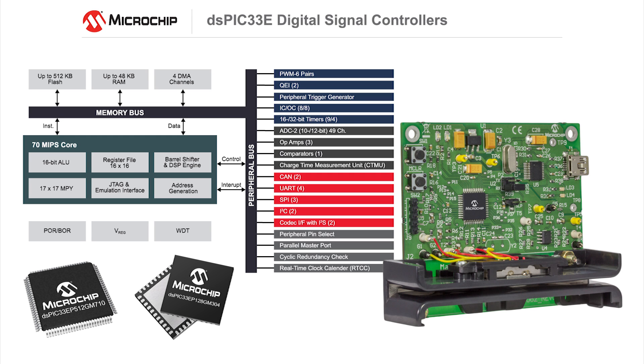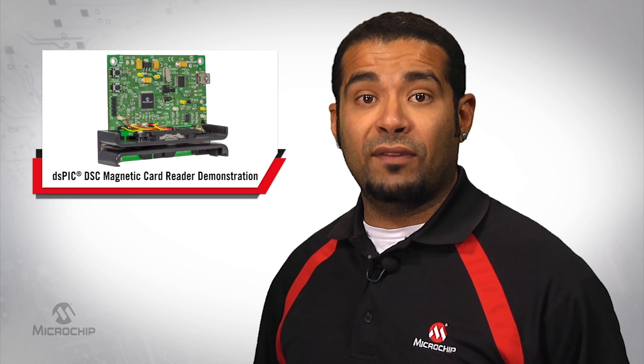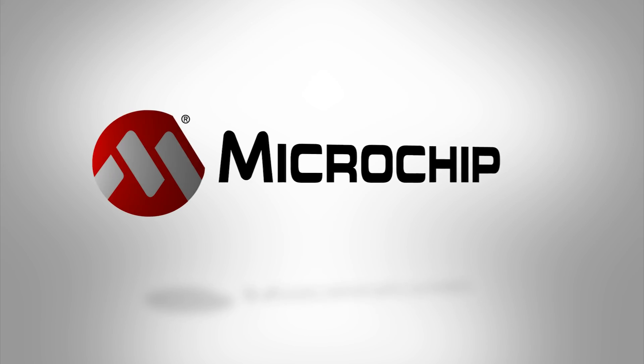Customers who prefer integrated op-amps can use the DSPIC solution covered in this tutorial. But in addition, Microchip also offers an alternate solution for customers who prefer a low power MCU with integrated crypto. These customers can use the PIC24F solution that features the extreme low power PIC24F family of 16 MIPS processors with on-chip A2D converters and timer interfaces. The difference between the DSPIC and PIC24F solution is that of the integrated op-amps. PIC24Fs do not have on-chip op-amps and hence use Microchip's external op-amp, the MCP6144.